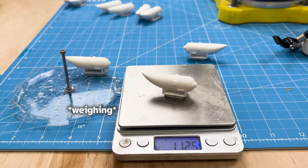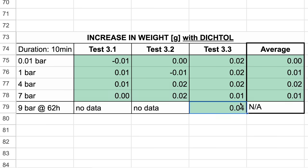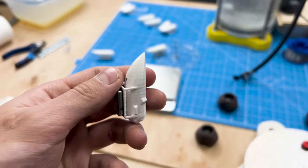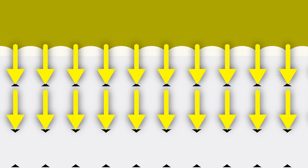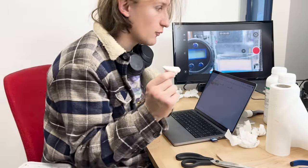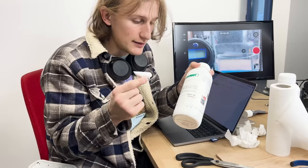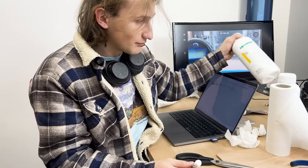The difference is, to say the least, pretty significant. Even at 9 bar, left for — I repeat — 62 hours, there's virtually no leaks or soaking whatsoever. How does it work at a microscopic level? Dichtol penetrates the pores due to the capillary effect. The water contained in this liquid evaporates during the curing process, and as a result the previously dissolved polymer remains and closes the pores, making it impenetrable. I actually can't believe that this substance made this print survive 40 meters underwater.